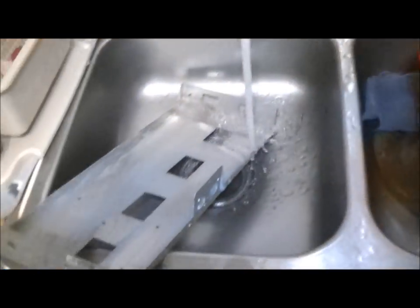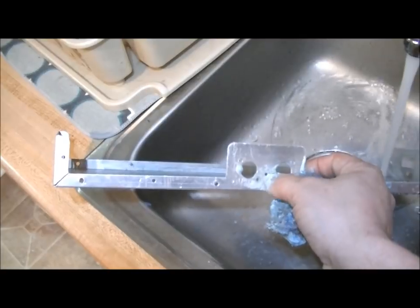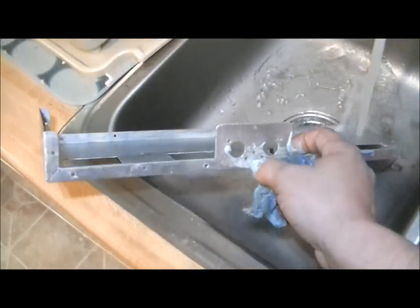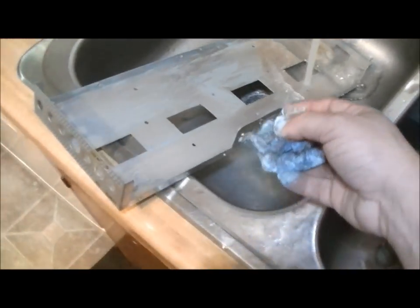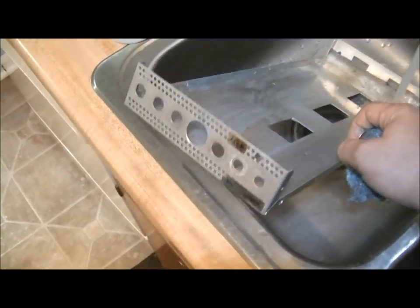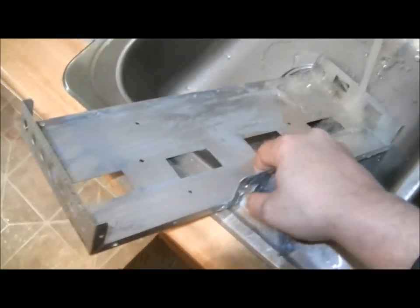Washing this thing down so we can get it looking pretty, then wash the heat sink after that. Another thing — for the bolts on the SO-239s, they use 4-40s, but I'm upgrading to 6-32 and putting some Teflon SO-239s on there since the ones that were on it have seen better days. I like to go a little extra for Mr. Dirty White Boy since he's been waiting a good while for this.